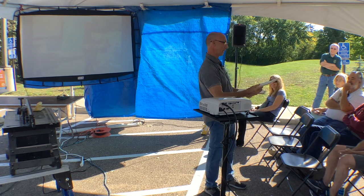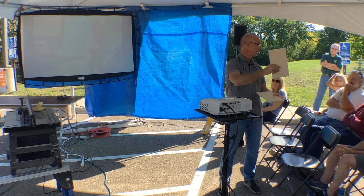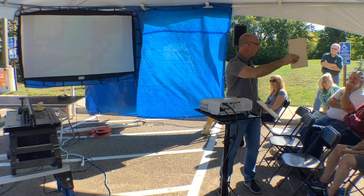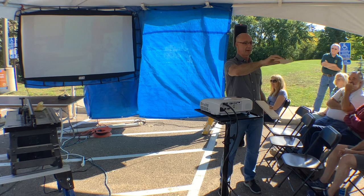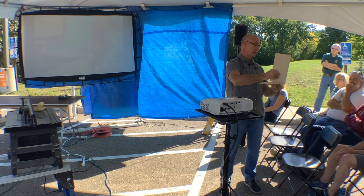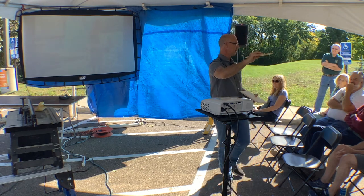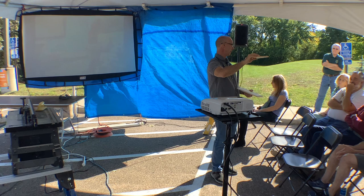What? Oh, this. Okay. If I put these together and it's all loosey-goosey, the tongue isn't big enough, you have to raise the cutter to make this component fatter. This is just a little bit too tight. I need to lower the bit to make this just a tiny bit thinner than it is.